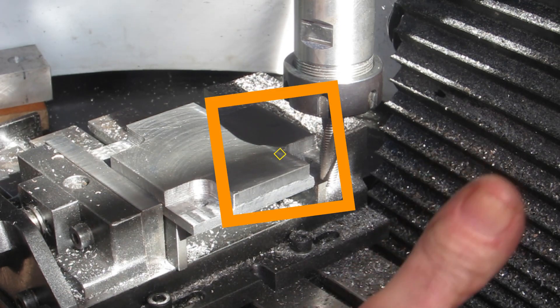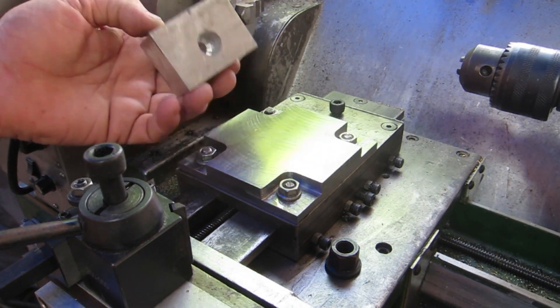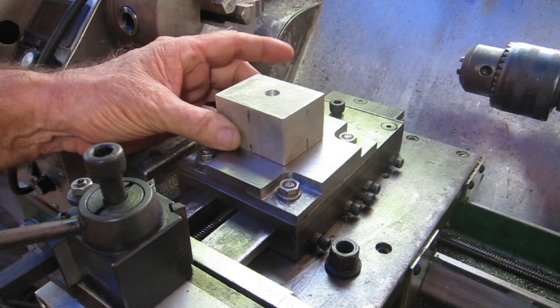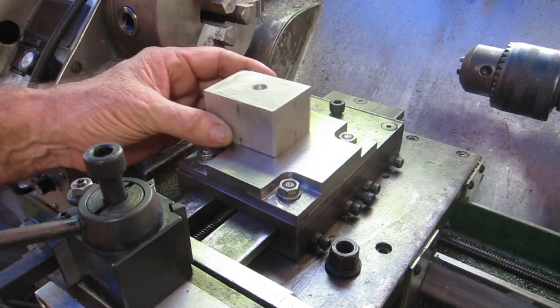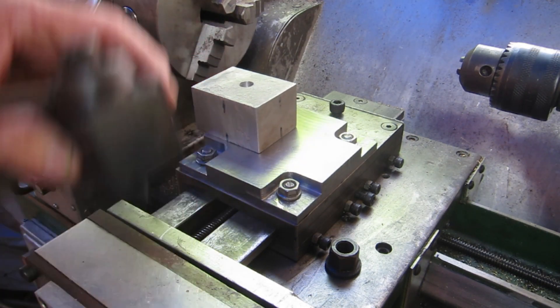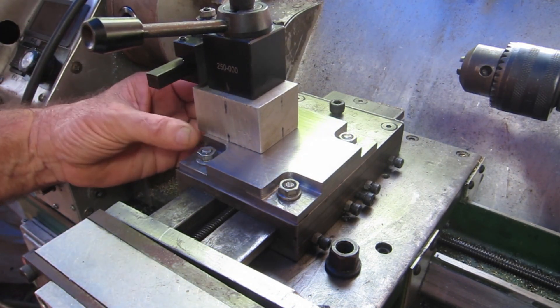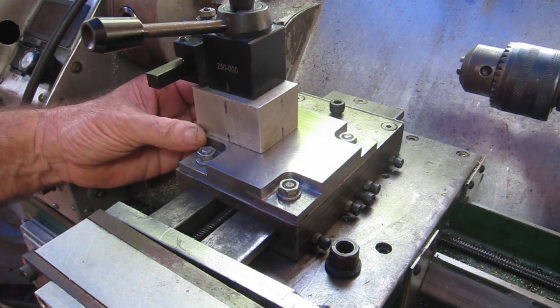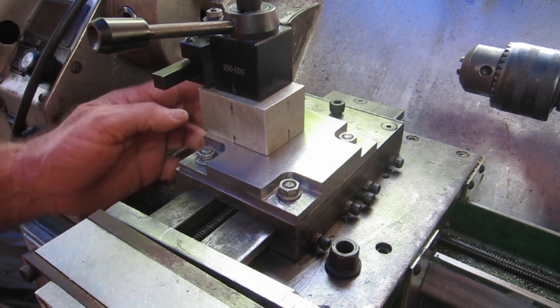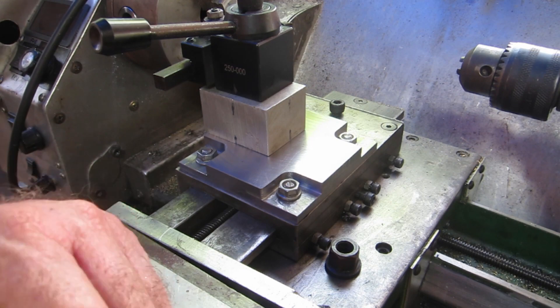That'll do, I think — takes a long time. Now that I've got this machined up I'll cut this chunk off. I've machined these two rough sides, you can see the fly cut. I should take a bit off the ends so I can move it forward a bit — I want to use that bolt hole there which will go right through into the steel. I don't really want it hanging out over the cross slide too much, but another three or four millimeters would be nice to get it a bit more clear so if you're swinging something big in there it's not going to be an issue.